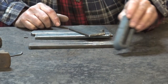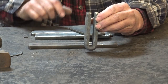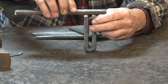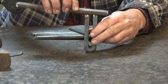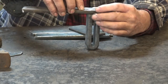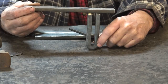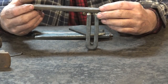The final piece is a hardy stem — a U-shaped hardy stem that will allow me to put a wedge in if I ever want to. I doubt I'll ever use the wedge, but it's an option that will be available if I need it, and it'll just weld on down here. Make sure you weld it square. A solid bar would work, but it was easy enough to forge the U-shaped stem, so that's what I'm going to go with.